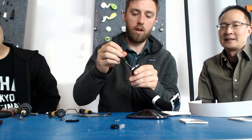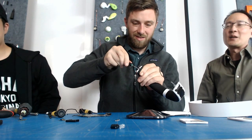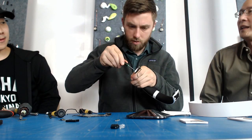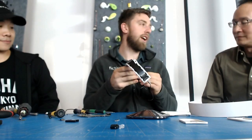And how did you prototype this silicone band, in the early models of an EVT, or maybe closer to the end? It's one of the more challenging processes. I believe there is now silicone rapid prototyping. Cool. Before that, we always had to use cast urethane. So we simulated with a urethane mold and urethane parts. It's not exactly the same. Nowadays, I think the rapid prototyping process is getting better, so you can do something similar. But this one was challenging. Yeah, we actually do that a lot. It's an RTV mold, room temperature vulcanization, cast urethane to do these, and we'll take it off just so folks can see. But otherwise, you can actually print in rubbers now.